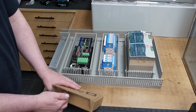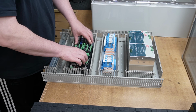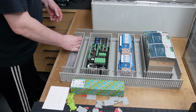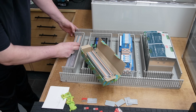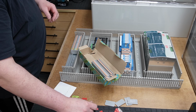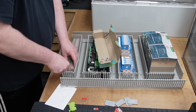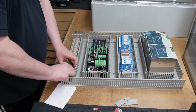The newer revisions of the breakout boards already have these terminals on board, and as well a couple of built-in solid-state relays, which makes things even easier. Last but not least, I add a total of 63 push-in terminals for the connections to the router. Homing sensors, tool setter, 2 different touch probes, one of them a wireless Renishaw clone, external control panel, e-stop, Z-axis brake, tool change, and the connections to the Spindle VFD Control Cabinet and the Pneumatics Cabinet. I separate each section with dividers for easy identification and added later on a dedicated number to each terminal.